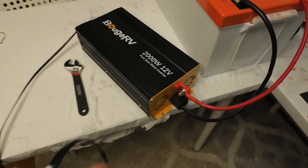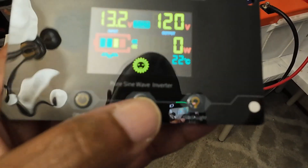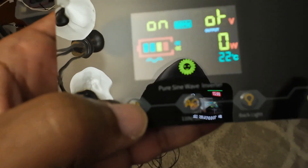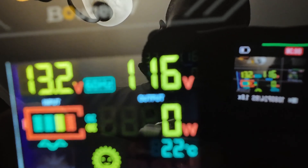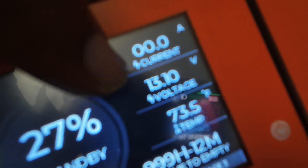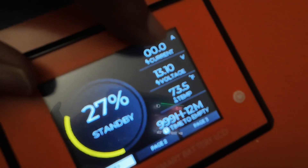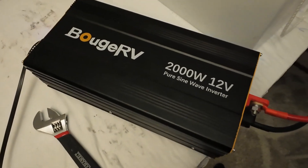I have not put the cap on this one, but I plugged the screen in and the screen is telling me it's 120 volts. You have power, you have the ability to change it from 110 to 120, and you could turn the display off. One thing I'm not fond of is that beep — I wish you could turn that off. It's saying 13.2 volts on the battery, and the voltage is building now. The battery display is showing 13.10 volts and no current coming out of it, so this thing is using so little power it's not even registering. I haven't plugged anything in yet — the AC inverter is now active, maybe in some type of standby or sleep mode because it's not powering anything.